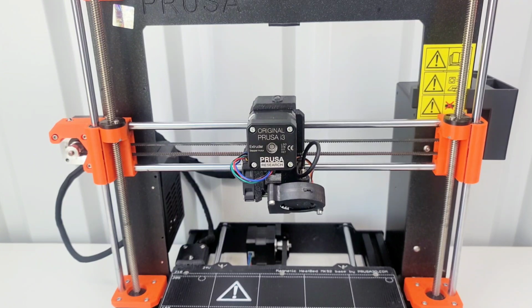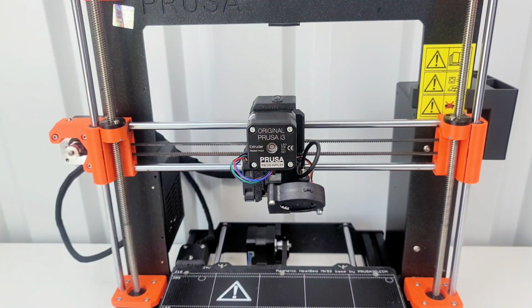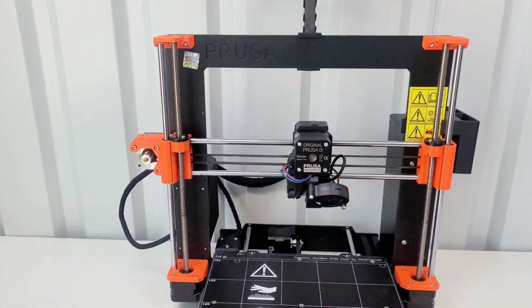and it says step 2, before you start, make sure that the filament is unloaded from the hot end. We're good on that. The printer is properly cooled down, yes, and it's unplugged, yes. So move the Z-axis to half its height and move the X-axis to the center. I feel like I'm pretty good on that, it looks like. I think there's a decent amount of room.